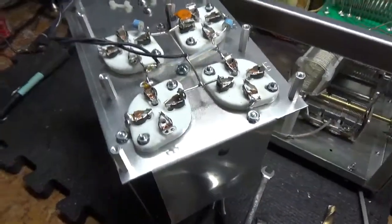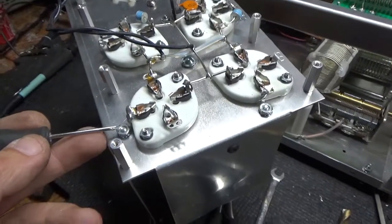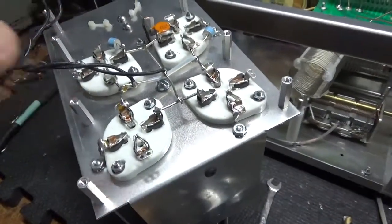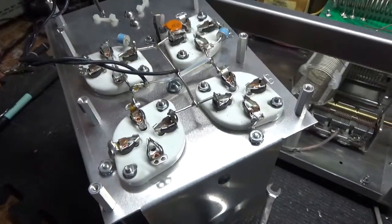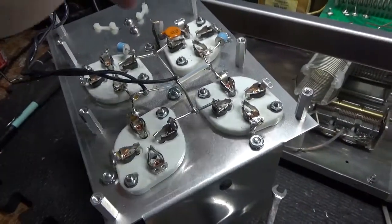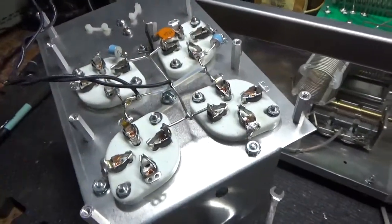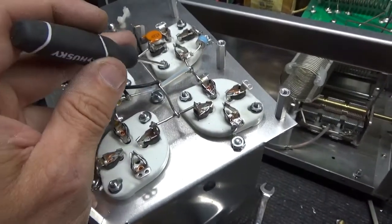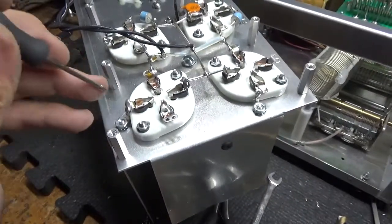All set. So let's go over it real quick. Each grid connection goes directly to the chassis now through a screw with a cap nut. I reuse the tab and I solder it. I also compress the clips so they have a nice strong grip on the pins and the sockets. I add the gas discharge tubes — one per side of the filament. Because all four are in parallel, you only need one per side. So now if a tube would flash from the plate to the filament, this will bring it to ground on either side. Some of these have a split washer under the head of the screw, but some do not. Either way, these fiber washers deteriorate over time and the nuts still loosen up. So it's critical to ground the grids directly to the chassis.